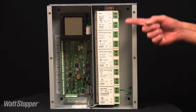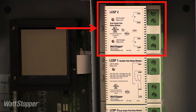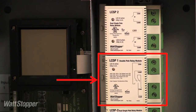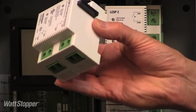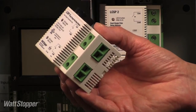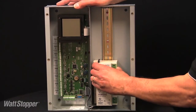The line voltage section of the panel has a DIN rail mount that will accept up to four relay modules for a total of up to eight poles of relay control. The LC-SP2 dual single pole relay module contains two independent 20 amp relays supplied in one module but independently controlled. The LC-DP1 double pole relay module has a single two pole relay rated for 20 amps at 208, 240, or 480 volts. The line voltage terminals on both modules will accept wire up to number eight gauge, accommodating long wire runs sometimes needed for site lighting circuits. The relay modules snap onto the DIN rail in any combination of single pole and double pole.